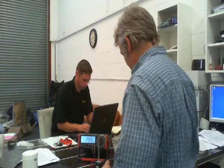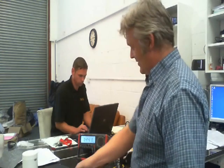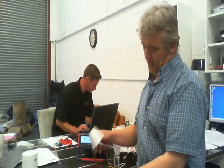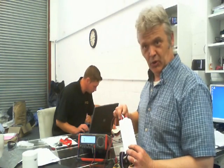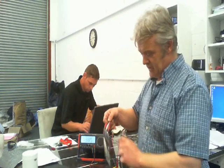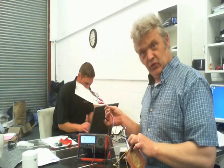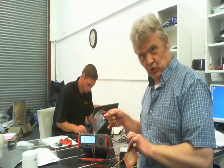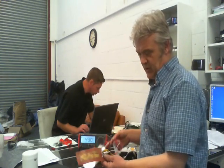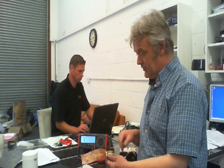Let's have a better look at it. That is just to hold everything in place, and on top there's a big metal weight, again to hold everything in place. What I've got here are two pieces of aluminium on polypropylene. You'll see that there are three leads attached to it: one lead goes to the metre, this lead goes to the other plate. With graphene oxide being an insulator, it's essentially a capacitor, so joining the two plates together means there's no current involved — it's neutralising itself. The other lead went to the battery.